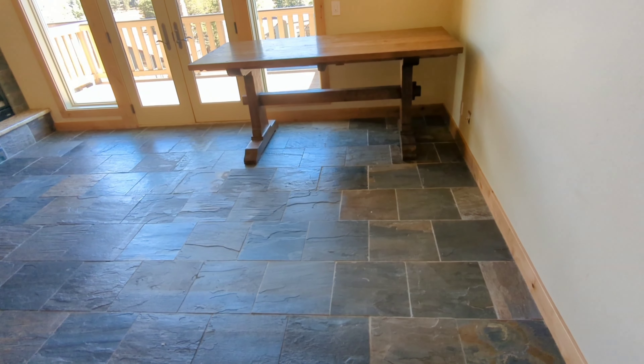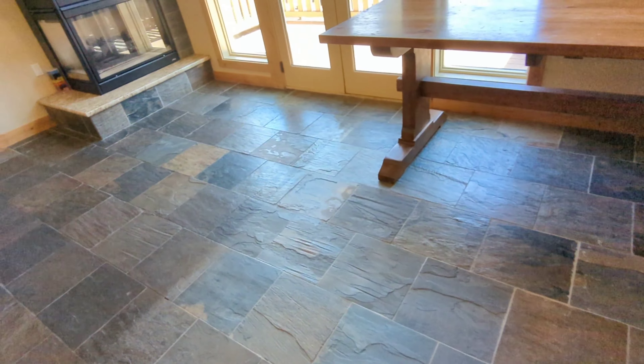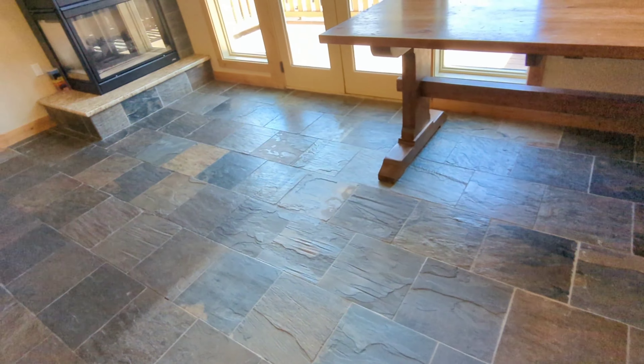So there's a slate floor — that's what it's supposed to look like. This is a VRBO, Vacation Rental by Owner. What you're looking at is kitchen grease, obviously, but also the effects of string mopping. A place like this has renters coming and going all winter long — ski bums — and they'll have a cleaning crew come in after each batch of renters. They're obviously using the yellow devil, as we call it, and just spreading the gunk around. If you've ever tried to mop a slate floor due to the shaling or rough texture, it's very difficult — hard to get them to move across.